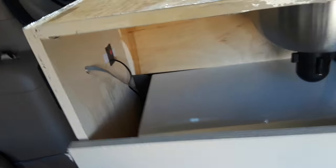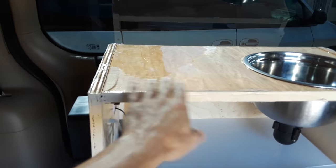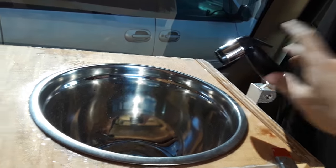With the solar, you need to use it for something. I built a cabinet, put resin on the top, and we've got a bowl here with a drain in it, so we have water. It's a consistent spray and it's not using power — it's actually using the Nemo Portable Shower. You just prime it with a foot pedal and it inflates. It can hold up to 3 gallons. I found a little mounting bracket for it. This is a Walmart salad bowl that I drilled a hole in and put a drain in. It drains out to a plastic bottle that can just be dumped out.